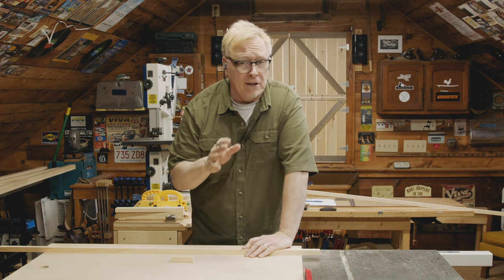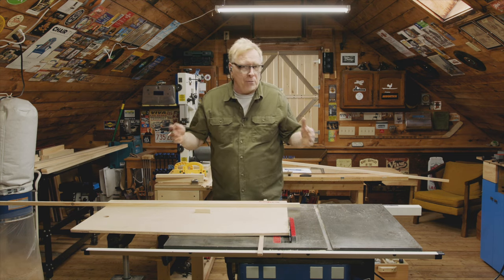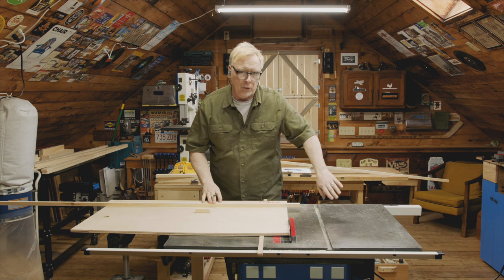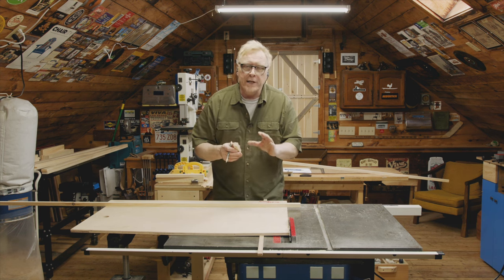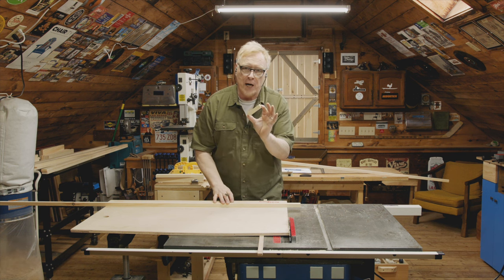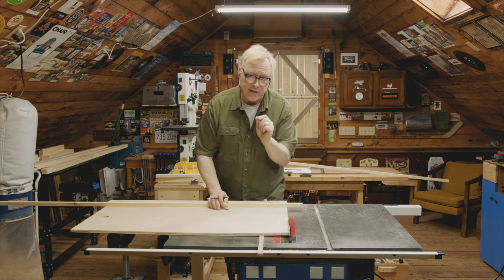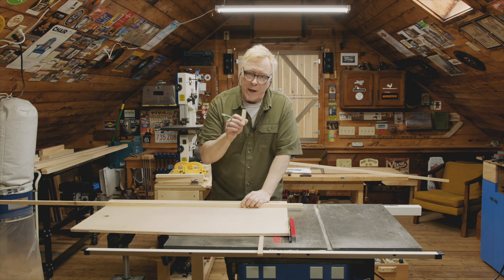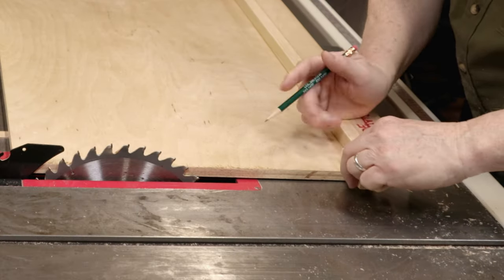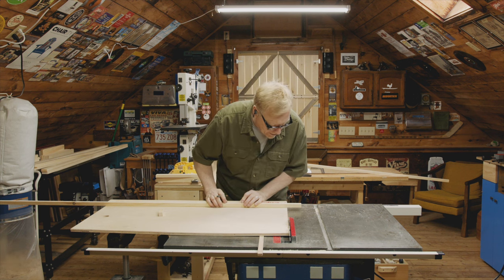We have all our vertical slats cut to length. Now we need to cut 42 three-inch spacer blocks. I'm working in a small shop space — normally I work on the other side of the table saw, but I'm using my cutoff sled on the right side. We need three inches as the end product for our spacer blocks. Because I'm on this side of the blade, I have to account for that eighth-inch thickness of the blade, so I'm using a sample piece that's three and one-eighth inches long. I'll flush it up to the end of my three-quarter inch piece and cut 42 of these.